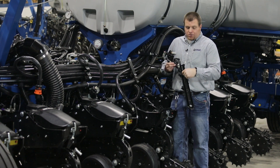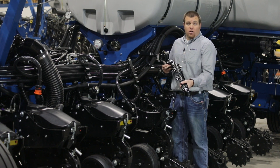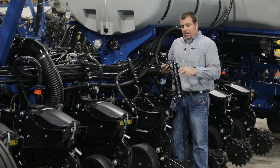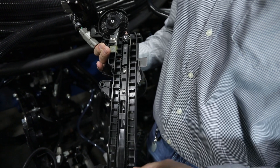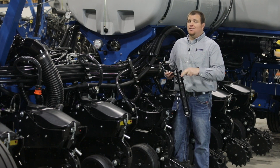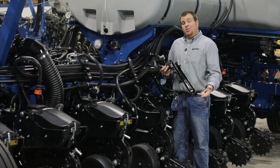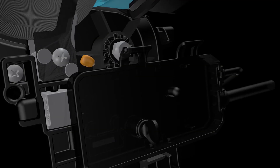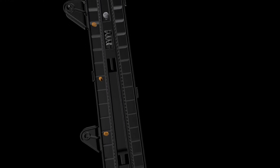As our brush wheel goes down, we go into our flighted delivery belt. Some unique items on our flighted delivery belt: it is a Kevlar reinforced polymer designed belt. Once you assemble it and set the tension — which it automatically sets with our spring-loaded tightener — you tighten it down with two Phillips head screws and you never have to remove or take the belt out at the end of the season, because of the durable and strong Kevlar reinforcement. The belt is really built for the long haul, with over 2,500 row acres on many of our belt deliveries in testing without failure or wear replacement.